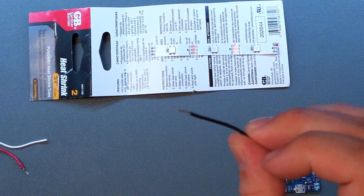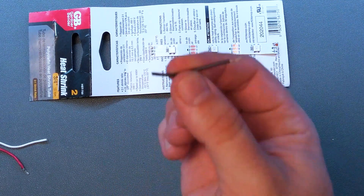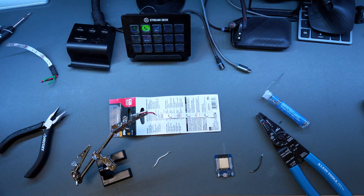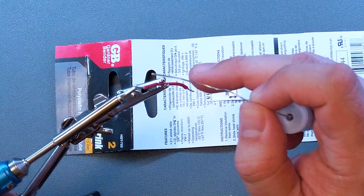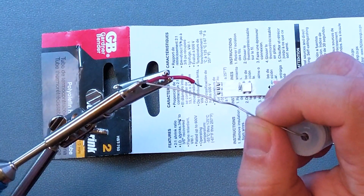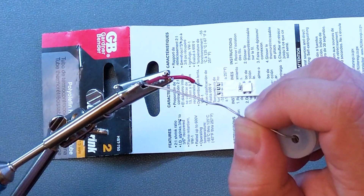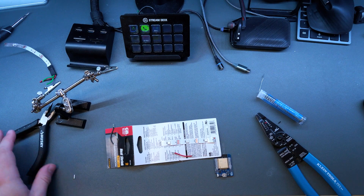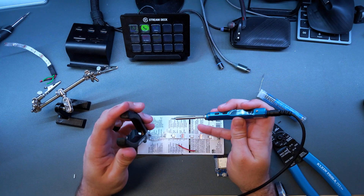I've already cut and stripped these wires down — both sides need to be cut, stripped, and it's a good idea to strip them in advance in case you make a mistake. If you're interested in the tools I use, I have a link in the description to my recommended electronics tools kit on Amazon. Once all the wires are stripped, go ahead and tin the ends of the wires. Place the soldering iron tip on the wire, let it get warm, and flow some solder right in. Get a good coating on there — that'll make the job much faster. Let's solder the middle wire first so you've got more space and don't crowd yourself.